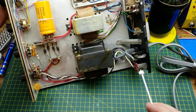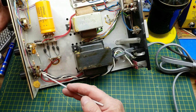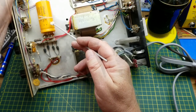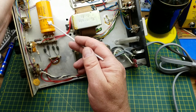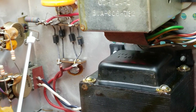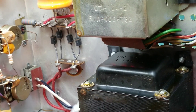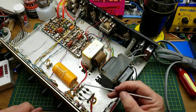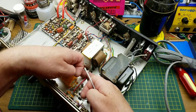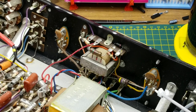So maybe we can follow this through from the start. There is the circuit breaker, power coming into this power transformer, wire going to the power switch on the front and back. There is the full bridge rectifier — insert Electroboom sound effects here. There is the main power supply filtering capacitor, which is a 3000 microfarad 50-volt capacitor. This resistor is going to the LED on the front panel — it's a red LED, of course, because that's all that existed at the time. I'm actually surprised it has an LED for the early-to-mid 70s; that's kind of modern and cool.